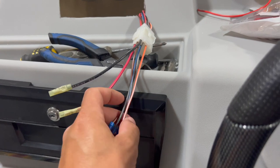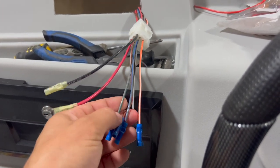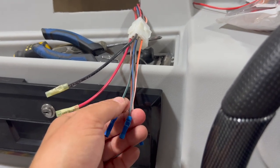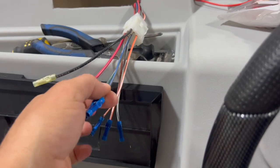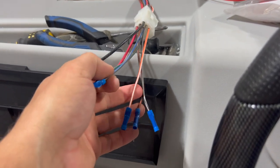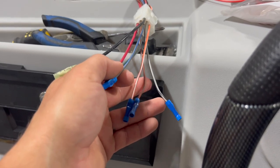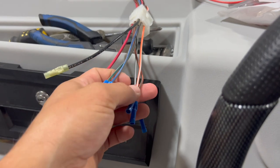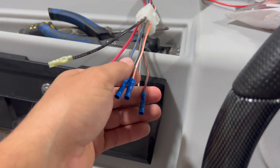The only ground I'm going to have to add is going to be for the interior lights that I wired in, because those are aftermarket and I didn't splice those into one of these wires. But then we have a horn lead, navigation lights up front — that's the gray with the green stripe. We have a gray with the blue stripe — that's our stern light. So these will become one and splice into one switch. Docking light is the gray with the black stripe. This would be an accessory wire for a live well or whatever, but we're just going to omit that.